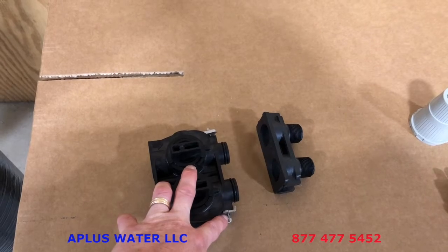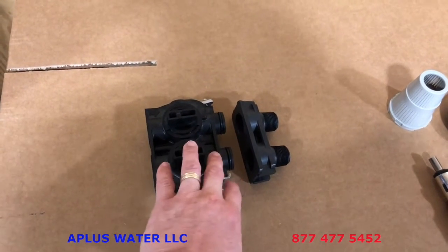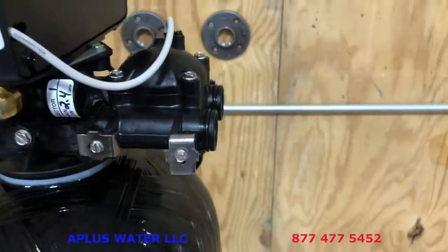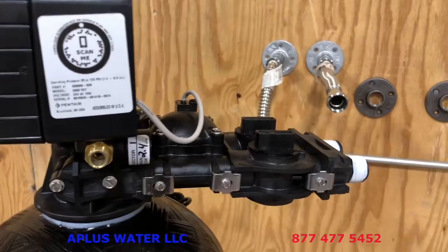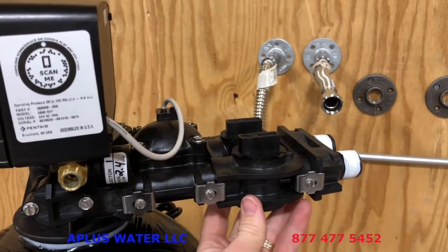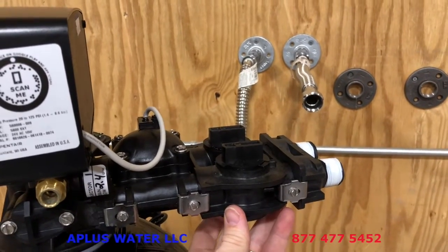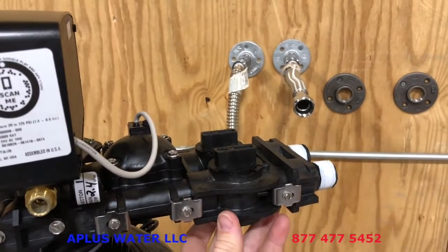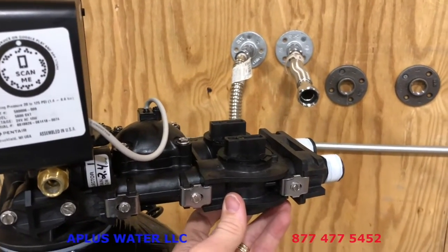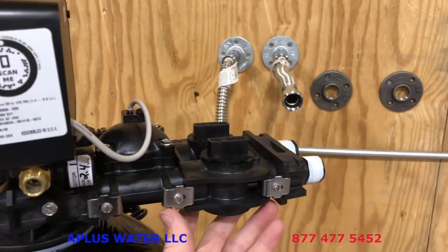All the screw needs to do is hold the clip together snug to keep separation happening between the bypass and yoke, and also the meter and the yoke and the bypass. We do have these screws only snugged up, and you'll see there is a little bit of play. That's designed that way, so when you plumb it in, there's a little bit of play there. Obviously, you don't want it torquing up or down or twisting the bypass when you connect your plumbing, but there is a little bit of play there. That is designed. Do not go and over tighten those screws.